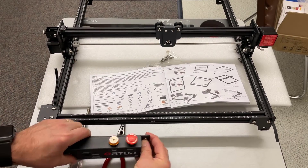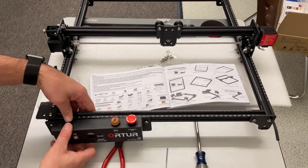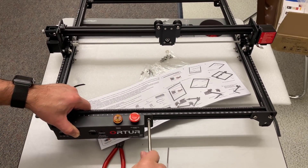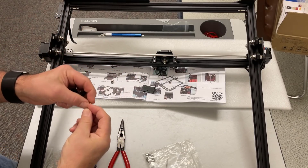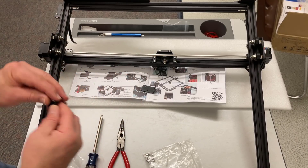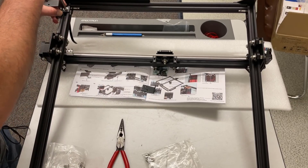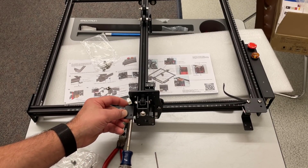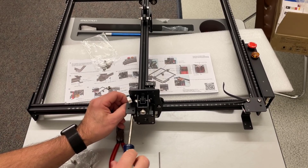It is time to install the motherboard. Make sure you slide that over so that you can find it and it doesn't get lost behind you. I'm going to tighten it a little bit first, then slide over and use the one that is part of the frame. Flip it upside down for a second - they want you to find what they call a loom, which is going to be the drag chain. This attaches up through so it comes down out this way. Thread the T-nut a little and then slide it in with the drag chain outside the machine, and tighten it in. Then right down here is where we attach the back bracket of the loom or cable holder.